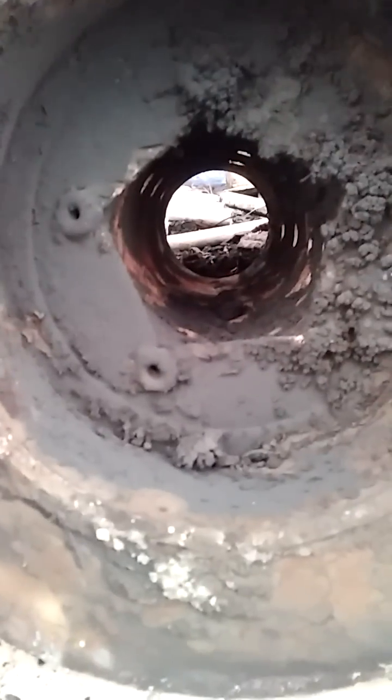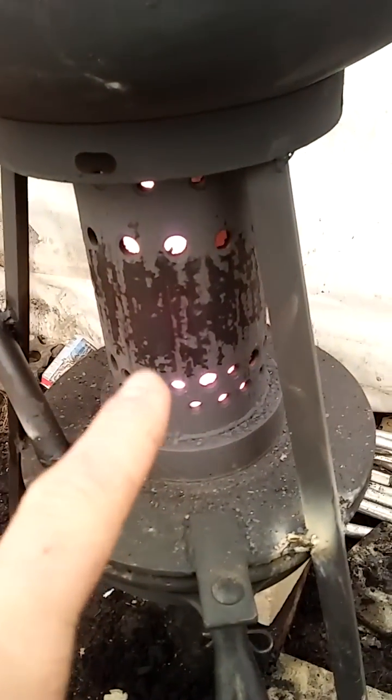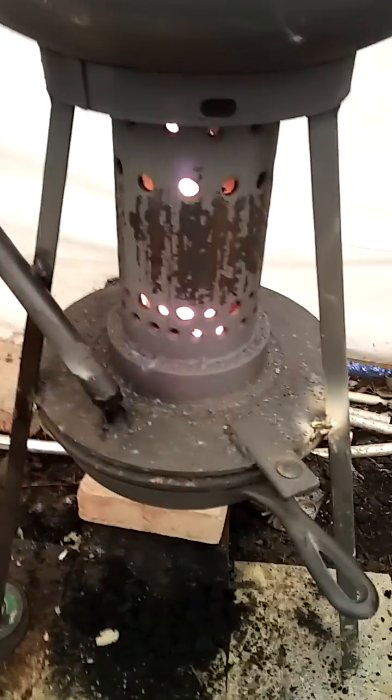There's fluffy soot that builds up from burning the oil — you've got to clean that out when you're cleaning your pan. Make sure when building one of these that your burn chamber pipe is the same diameter as your flue or smokestack, because you want the proper airflow suction going out the chimney to suck the flames up and bring air in through the holes. Otherwise it won't burn properly and you'll have a lot of smoke and soot.